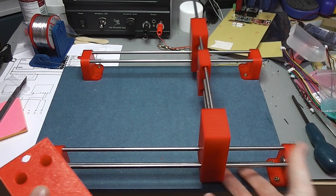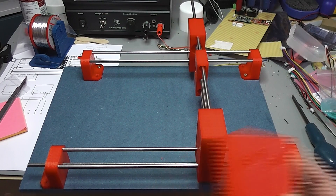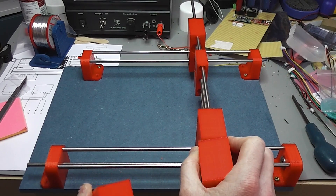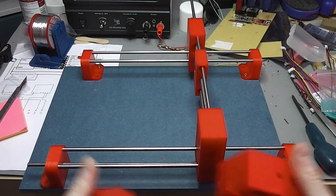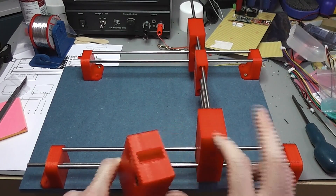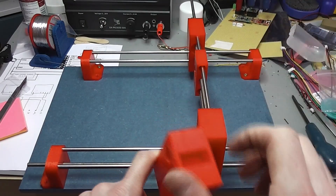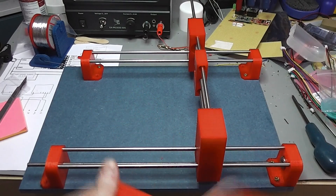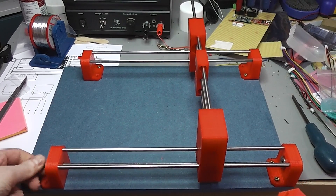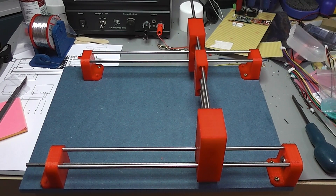The anti-backlash nut arrangement is mounted in the bottom here - the same mechanism I mentioned previously, and that's looking alright. The issue is the width of this. The previous one is slightly wider, and the anti-backlash nut with the spring worked really well inside. For this one I knocked off a couple of millimetres on each side to reduce it, but that's compressing the spring more, increasing the tension, and making it really stiff to rotate. So I'll probably go back to a slightly wider design to accommodate the original spring setup.